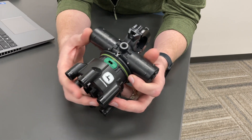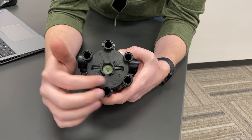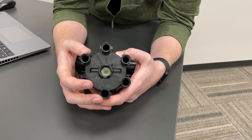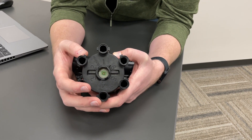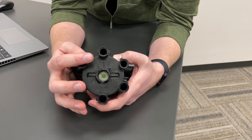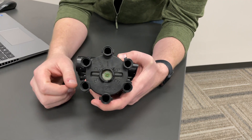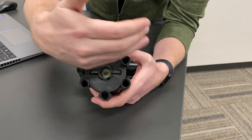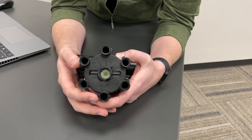It allows additional flexibility to switch in a pulsing mode from the front or the back without getting out and having to turn the turret like with our conventional five position turret. We do recommend that when you set up your turret and put your tips on, you think about which two tips you might want to use on the same day or under common application scenarios, to prevent having to get out and turn the turret. Line up the tips across from one another that you're commonly going to use together.